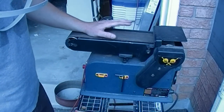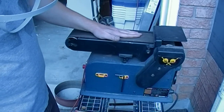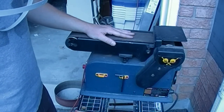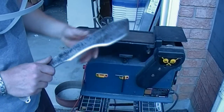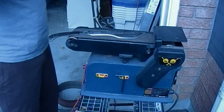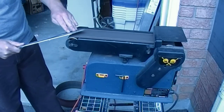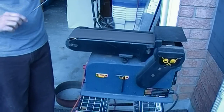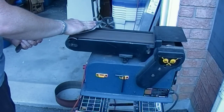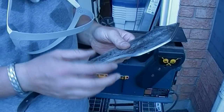So this is a belt that started at 120 grit. It's been used quite a bit, so to me it feels closer to 220 or so, 240, whatever it might be. That's just fine, because we're done with the stock removal. Now we're putting on that edge, the final edge. There we go, that's looking great. Now we're still experiencing edge rollover, but that's fine.